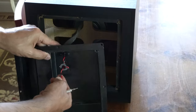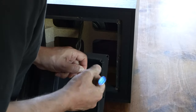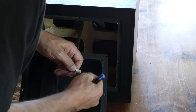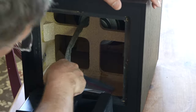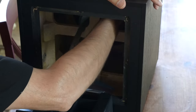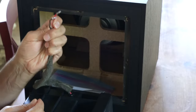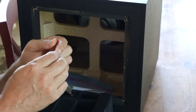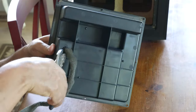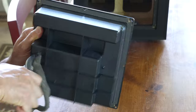First we're going to take the wire out so we can mount the wood. These usually you have to push down and then pull. I just realized the speaker wire is actually not soldered to the driver — it's just those old push connectors. If you ever see those, the first thing you do is replace them. Just get a wire and solder them instead. You really do not want those rattling inside. Basically you need to squeeze it tight, a couple of twists and it should come out.